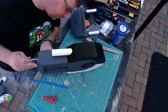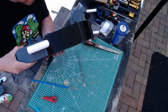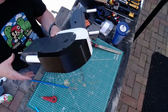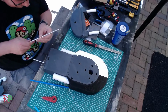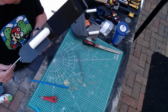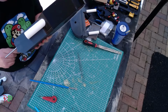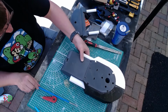Put the threaded rod in. And then screw it in against the M3, against the square nut. That gives you plenty of threaded rod to work with then. I mean, it says 300mm, 30 centimetres. I cut the threaded rods to 30 centimetres. You could potentially cut them a bit longer so they're outside the ankle and you don't have this problem. I just found this easier in the end. And when I come to build the other leg, I just build it this way.